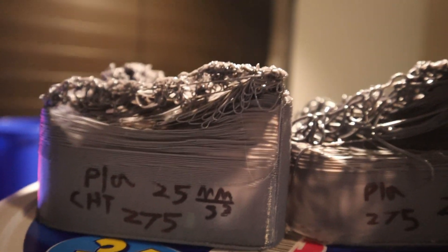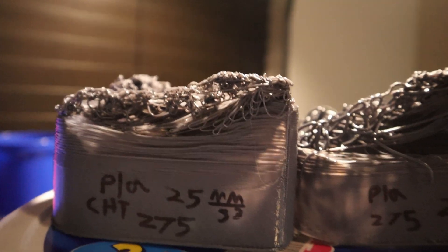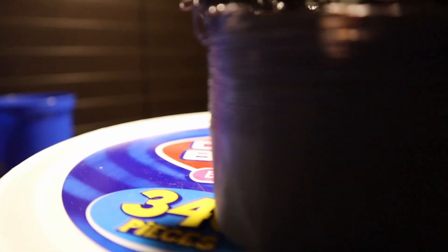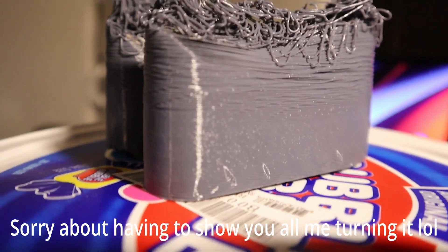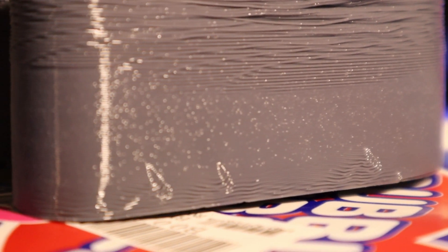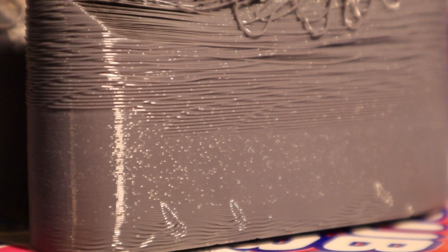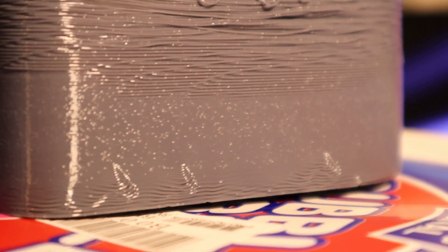Here's them next to each other. The CHT is able to stack taller, though there's something interesting about this one. If we get light on it and look at the back — it's got these weird bubbles in the extrusion, and I'm not really sure why that's happening. It didn't happen with the non-CHT. The filament is dried and I printed all the models in the same day within a couple hours of each other, so it's not moisture. It's just a weird CHT artifact, and this is on the genuine Bondtech CHT.